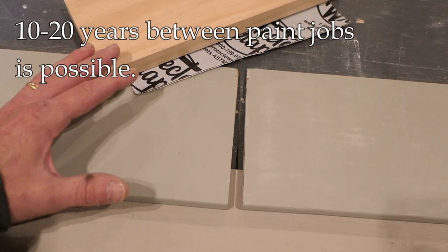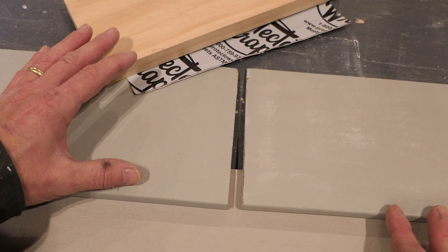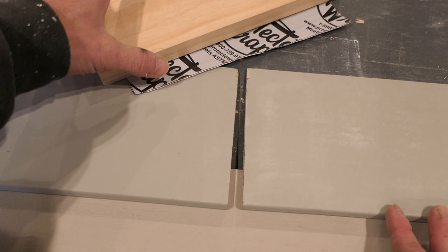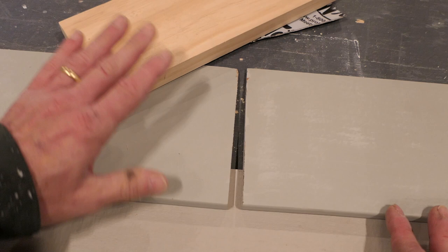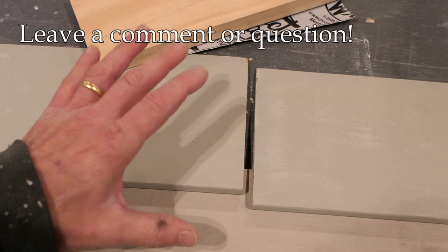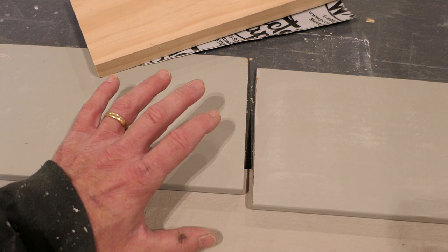If you're meticulous about all these tips and tricks, you can easily get 10 years out of a paint job, even with a southern exposure, and in some cases as much as 20 years. Be prepared to do some touch-up on trim, because trim takes more of a beating — especially horizontal trim like a water table. But if you just touch up the trim, the siding itself can easily get 10 years. If you have a special concern or question, please leave a comment. I'm very passionate about wood siding — I think it got a bad rap because people weren't installing it very well, but if it's installed correctly, you can get a lot of life out of it.